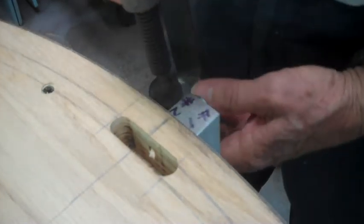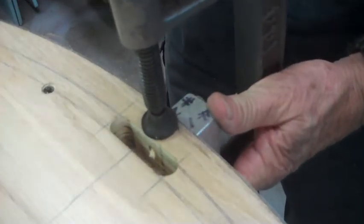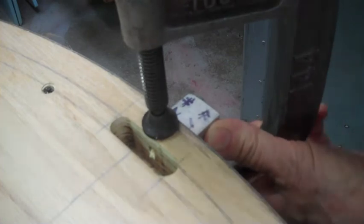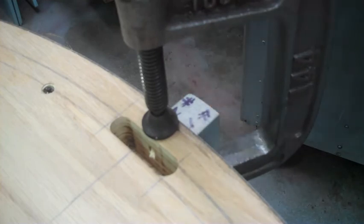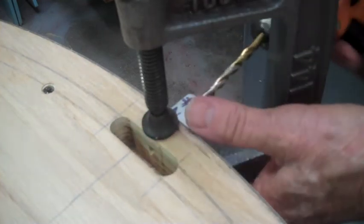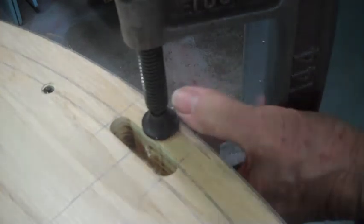Put the clamp back on. The bolt back out. Now we use another drill with the quarter inch bit in, and we only go in to the pocket, not up where the threads are at. Okay, and then we take this back off, and now we're actually ready to put a bearing in.